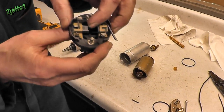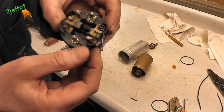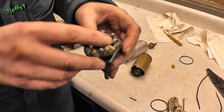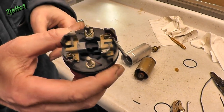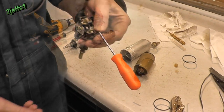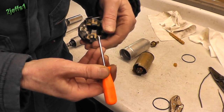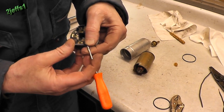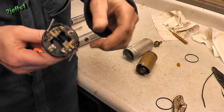It's kind of funny when you're taking this stuff apart and you hear the brushes go clack clack — you know there might be a little challenge ahead to get the tension off of them to get what you're working on back together. What I came up with here: you can see your load spring on the end of the brush. I took a chunk of house wire, stripped it back, and slid that over the spring — that takes the load off. We'll do side B here and I should be able to get it back together.